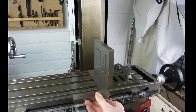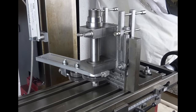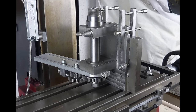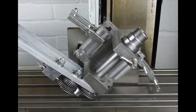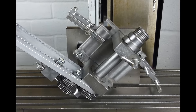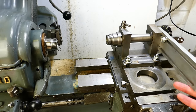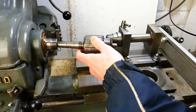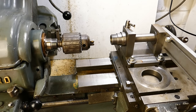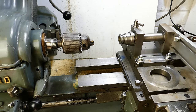It's a big advantage to be able to use the dividing head in the lathe, because although the dividing head can be set up vertically in the milling machine, the height of the milling machine head is limited, which greatly constrains the size of work possible. This is much less of a problem on the lathe because the carriage can be moved a long way over to the right and the setup can also be more rigid. The cutting tool is fitted to the lathe spindle — typically a drill chuck or a collet chuck for a milling cutter — allowing things like holes or slots to be machined either parallel or square to the work's axis.